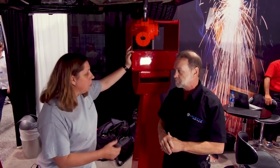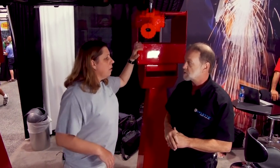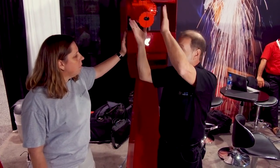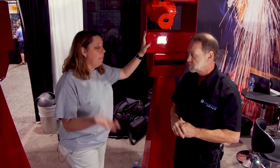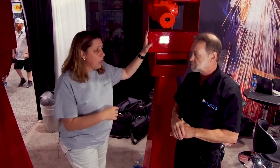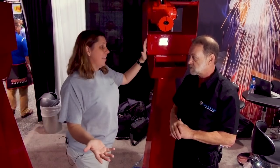If you want several measurement points, you can start here and measure the four targets you may have pre-hung, then move the targets and measure the rest of the points. Or you can take the head down — now that we know where everything is — move the head to another known location and continue measuring from there. Start to finish, you can get the car in the shop, put it on a lift, find your targets, use the laser, and have the car measured and done in about 10 minutes.